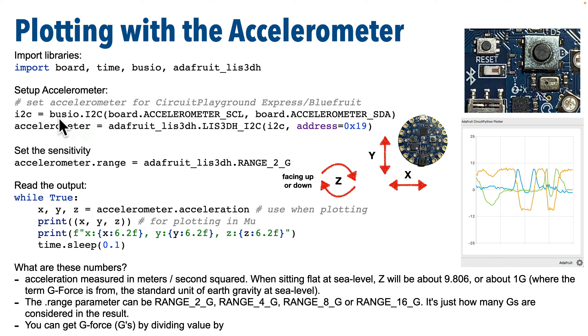These lines tell that standard where the connection can be found, then create an I2C object. Once we have the I2C object, we use it to create a LIS3DH object using the library we imported. Those are geeky-sounding terms — don't get intimidated. Think of these lines as software Lego: whenever you want to work with a built-in accelerometer on the Circuit Playground, just use these two lines to set things up, and refer to the variable 'accelerometer' in your code. We use the accelerometer's dot range property to set the range — I've set it to 2G. The G stands for g-force. This is usually fine if you're detecting motion for objects at rest; you can increase to 4G, 8G, or 16G for more forceful motion.